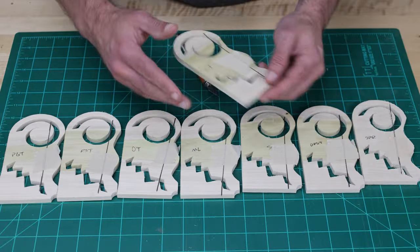Next is the skip tooth blade. Overall it performed okay. The cut quality is smooth, maybe not as glossy smooth as some of the other ones, but still a good cut. Stayed on the lines just fine, curves were just fine too, and it was able to cut really fast through it. The downside was the tear out on the backside. There are a couple spots that are super deep gouges that I would definitely not have this as a show side in any way at all. Some really big frayed split ends on this plywood.